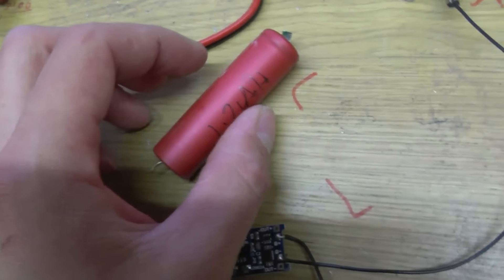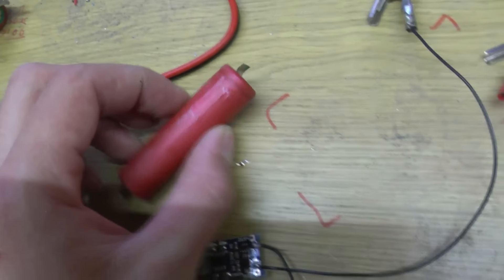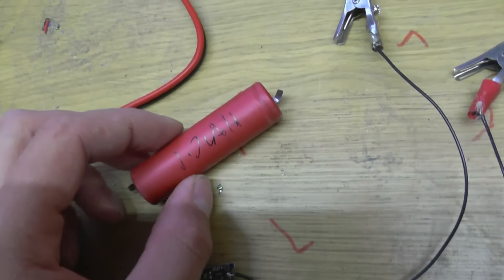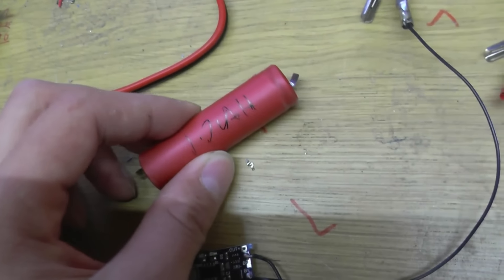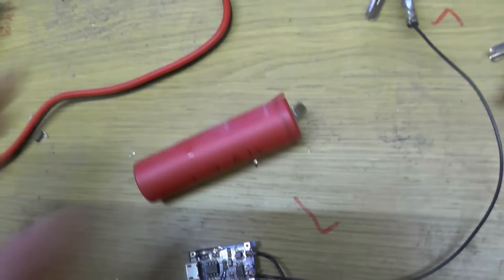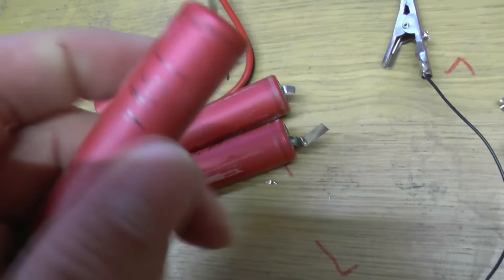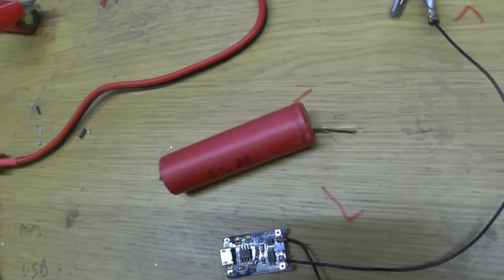So how do I sort my good from my bad lithium cells — my bad 18650s? After stabbing around in a laptop battery or cutting them apart, I have to charge them up. The best way to charge a dead or flat lithium cell — emphasis on the dead — because apparently you can't bring these back once they go past 3 volts. But these cells, along with 100-odd others that Stu sent me, prove otherwise. With a little bit of patience I've got some back up to 1.7 amp hours, 1.4 amp hours. The majority came up to just above 1.5 amp hours — 1.592, 1.586. They do still hold a capacity.